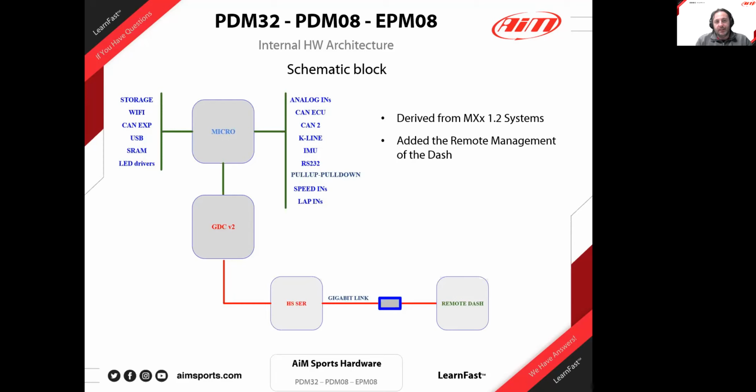About the external frequencies, we chose to not go higher, because in many situations, if the user moves the system to higher frequency, where, for example, it is not necessary, you can introduce more noise on the signal itself, and the result is that you have a less accurate system that you can use.